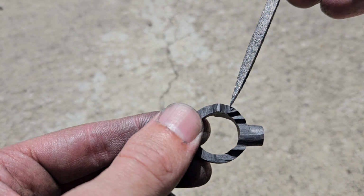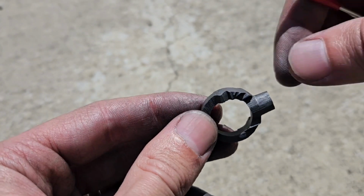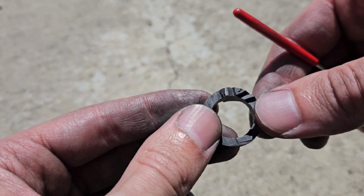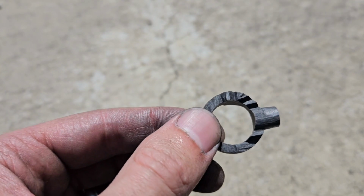Obviously I'll have to take out all of this. But you have to think ahead for all of the different design features of your model to make sure that when you pull it out, none of them are going to break the Delft clay.